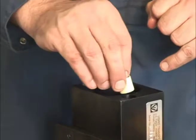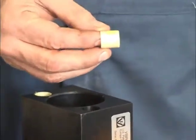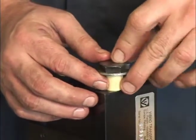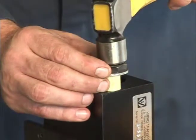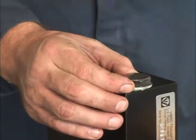Now, to reinstall the bearings, look for the tapered edge. Add a small amount of lightweight oil to the bearing to ease the reinstallation process. Place the Vibro bearing punch or similar shaped bolt against the bearing. Drive it home until it is flush with the seat. Remove excess shavings. Repeat this process to reseat all four bearings.